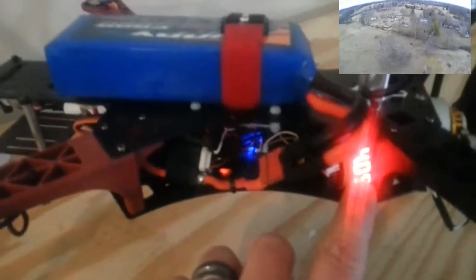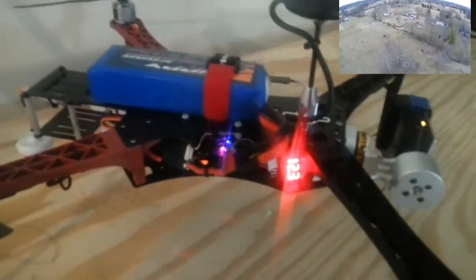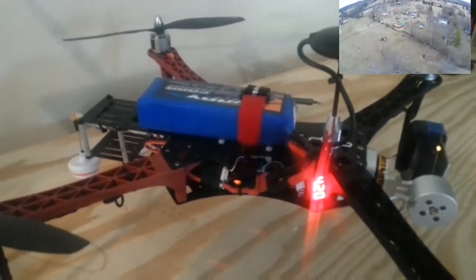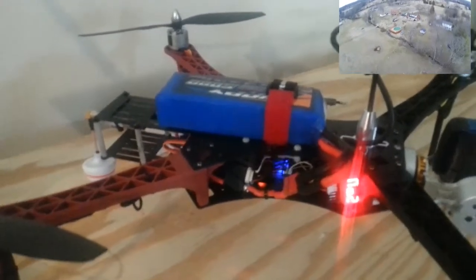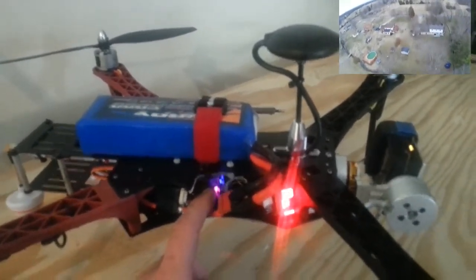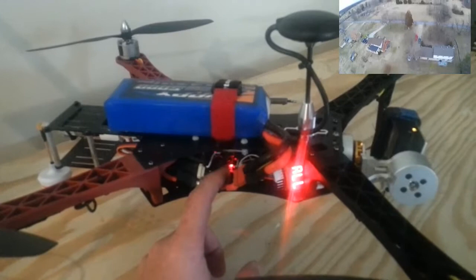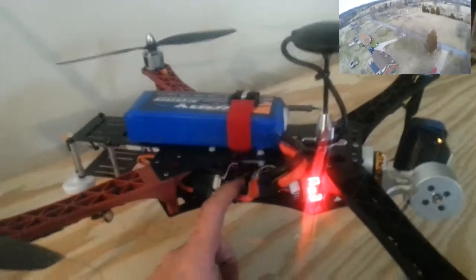Now I've got it plugged up. The camera's on. This display down here is a battery sensor, so if it gets too low, it starts beeping. You never want to trip that because if it's going off, you need to go ahead and land immediately. You have maybe one and a half minutes of flight time left. This is the APM 2.6 board, and it has a fail-safe built into it. What that means is it keeps track of your battery, and once your battery falls to a certain voltage, it goes ahead and initiates a return to home. That is super, super important.